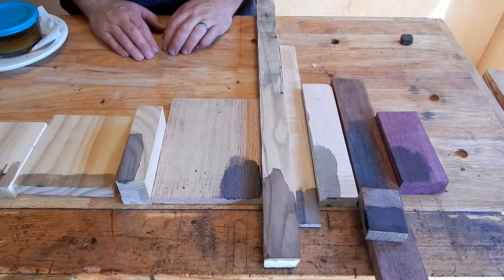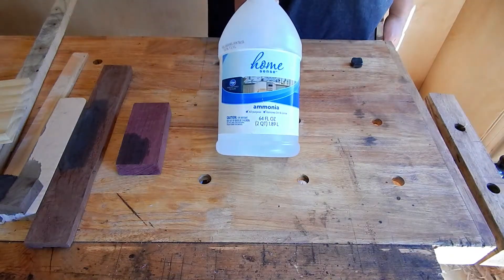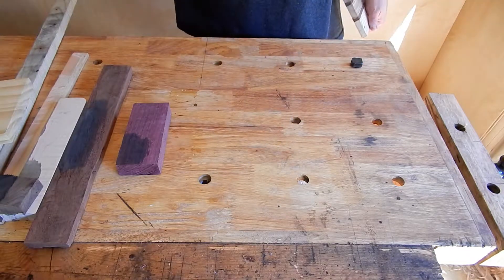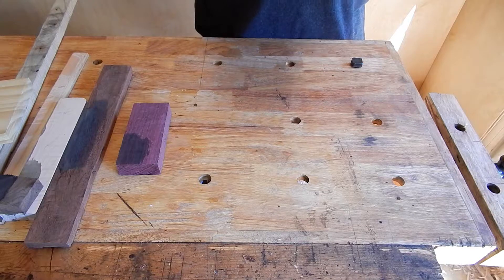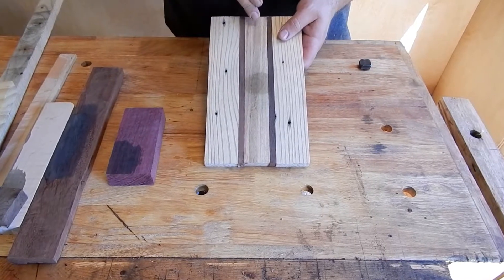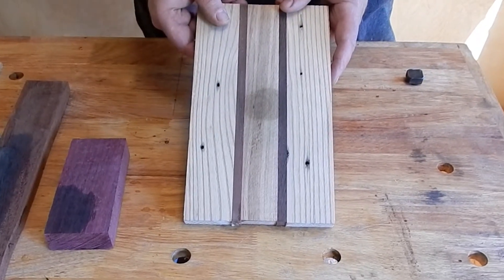So there are the results. Let me know what you think. For today's bonus content, we're revisiting my ammonia video from at least a year ago. One of my viewers commented that I should have tried it on white oak instead of red oak, and that's because it's a common way of aging it. So here is a strip of figured white oak, and as you can see, I put this over the bottle overnight and it certainly did age it nicely.